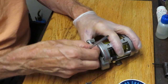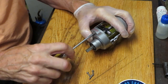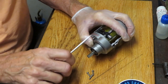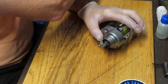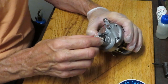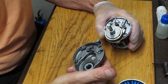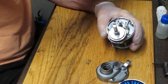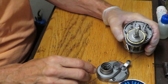There's one more screw after that. When I take these out I put them all in the same spot on my table. I want to make sure all the screws are the same before I put them into my parts tray — if there's a long one or a short one, I want to note what position and hole it came out of so I put it in the proper place when reassembling. This occurs particularly on Daiwa and Shimano reels. With those four screws we should be able to remove the side plate, though I'm noticing there's a bearing up top here that may come out. My parts tray is nothing more than a fast food container — I use the corners to store and keep the pieces separate.